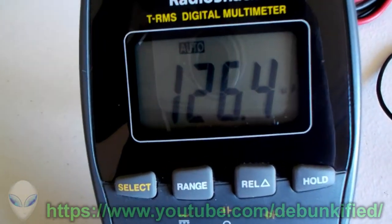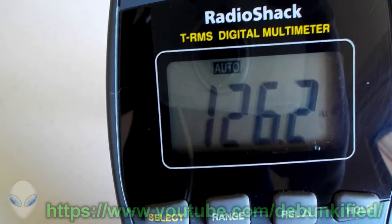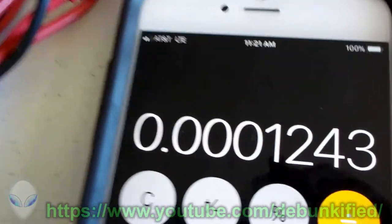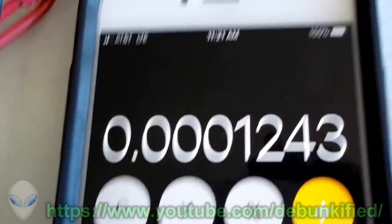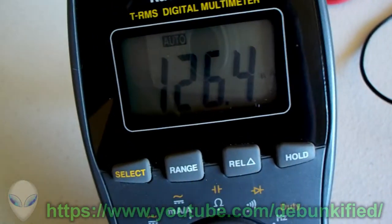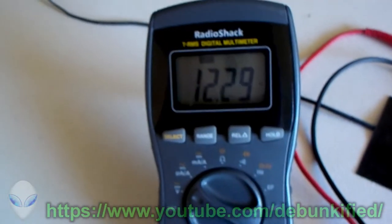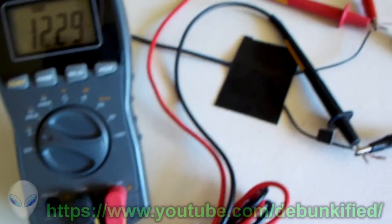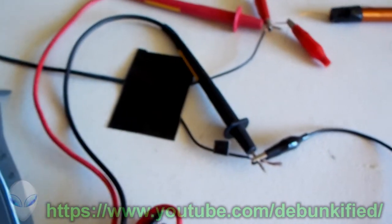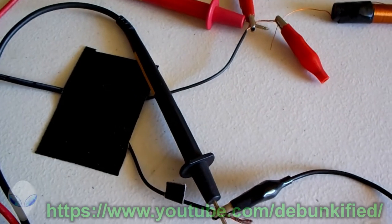And you gotta remember, part of that includes the little microamp. If you subtract that, then we get closer to what we actually calculated, because we only included the resistor in our calculation and not the capacitor's current leakage. So this is right on, and this is the actual current coming through. So let's route our way through this circuit. We got our voltmeter right there on our input, and this is the power source we're pulsing and that we're looking at.